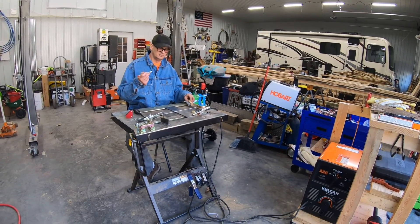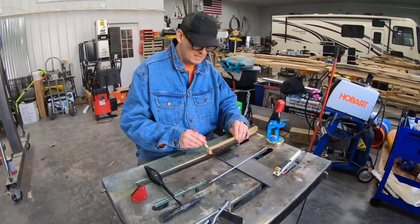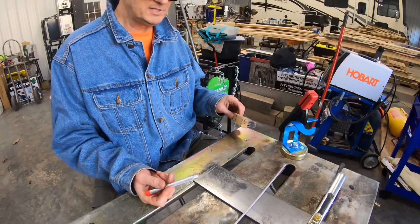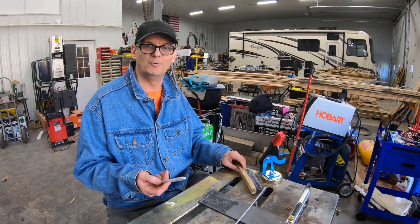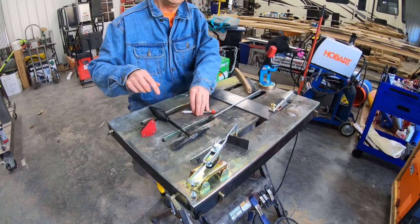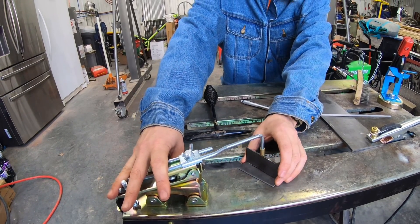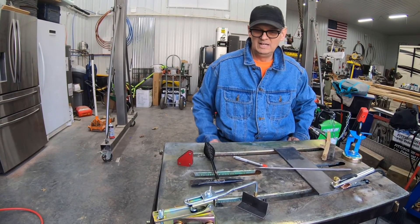Today I've got a little addition — I've got a soapstone, and what I'll do is just make a straight line and try to follow that line as I'm welding. Soapstone is good because the heat from the arc will just basically evaporate it — it's talcum powder — so it won't corrode or contaminate your weld. I've also got a magnetic clamp for T-joints. I saw it on Amazon for about 20 bucks. It can hold your T-joints up for you.